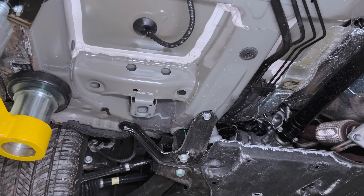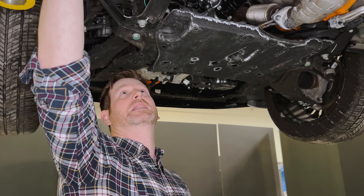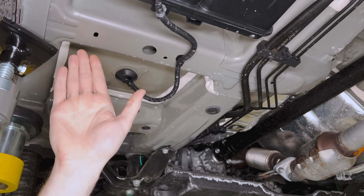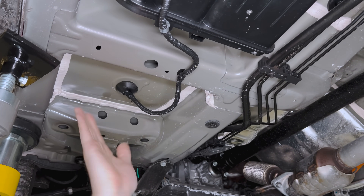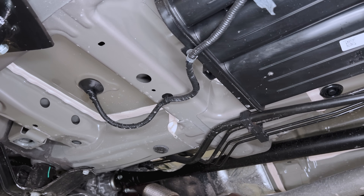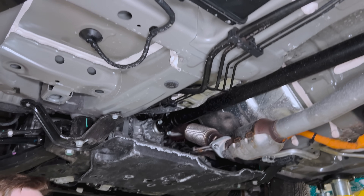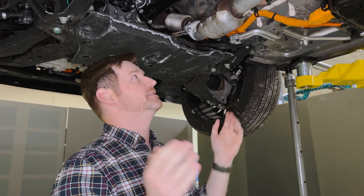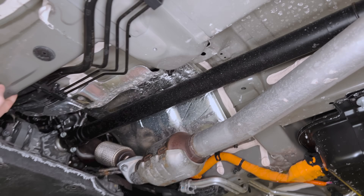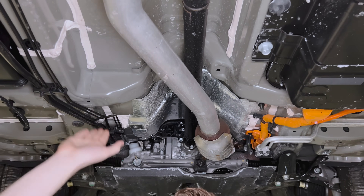One thing common between ICE and EV is that on ICE vehicles, Kia likes to do a kind of lattice structure on the underside going back and forth, whereas on EVs it's all on the top — piggybacking off the seat structure on the EV9 specifically. On their ICE vehicles, they probably complement the main motor bay rail as it comes underneath to the sled runner running rearward.